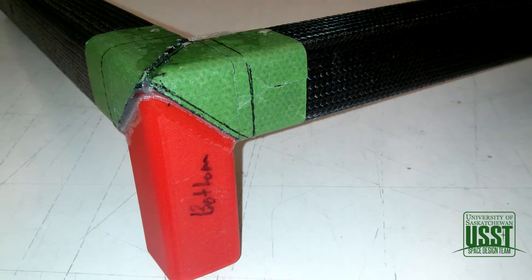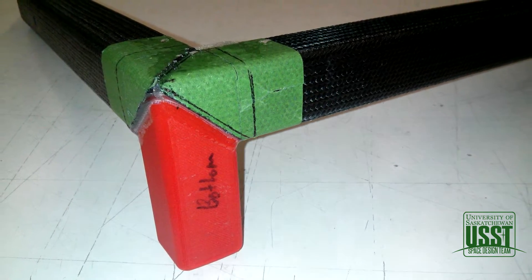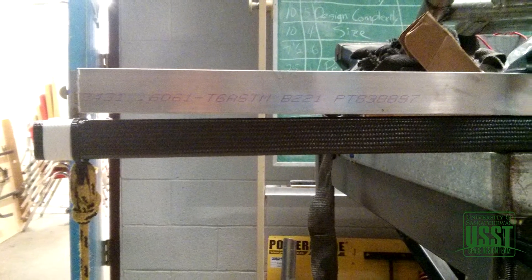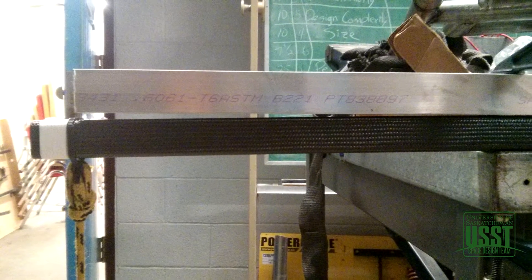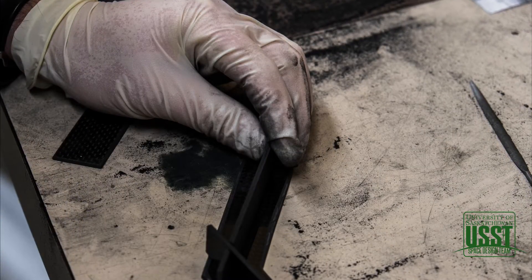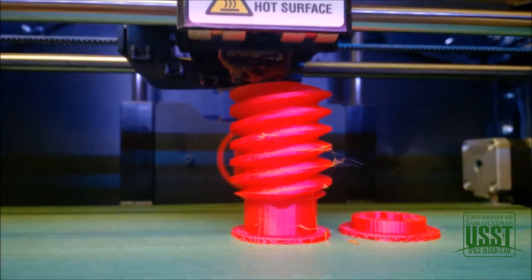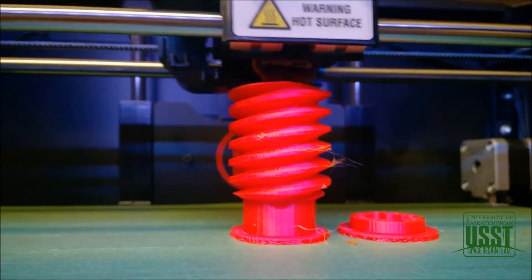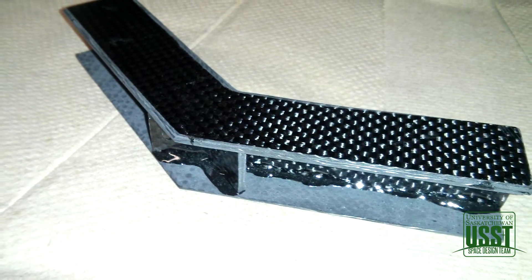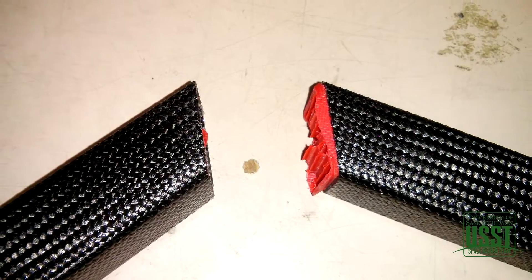One of the things we're really excited about in our design this year is the use of carbon fiber in the chassis. We were able to do a lot of destructive testing and comparative testing to aluminum, and we're very pleased with the results. We've been able to reduce the weight of the rover by 50%, and at the same time make much better use of the tools we have here — for example, our 3D printer, which we're able to use to make very strong joints very quickly and quite cheaply. It also leaves a lot of room for improvement: next year we're hoping to expand this into a unibody design process and reduce weight even further.